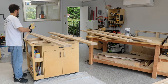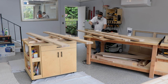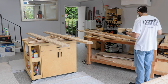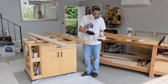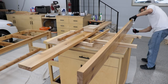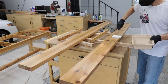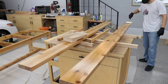I spread everything out, got it nice and clean, and used the tack cloth. I think I've been watching way too much Keith Johnson lately because all I could think about the whole time was 'Total Boat, baby.' We're using TotalBoat marine varnish on this one, and it actually went on really nicely — this was my first time using it and I was pretty impressed. It rolled on really smoothly. I ended up doing five coats total, and after about 45 minutes in the weather I had, it was dry and ready for another coat. I applied it to the bottom surface first, went through all the other pieces including the frame, and by then it was ready to flip and do the top and sides. We kept doing this sporadically throughout the day to get all five coats on.